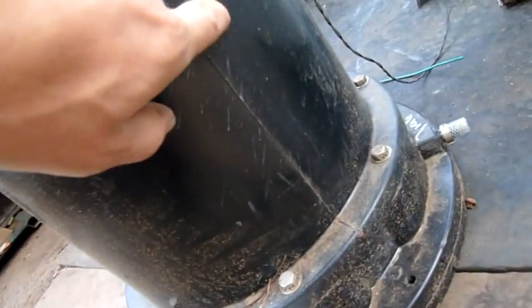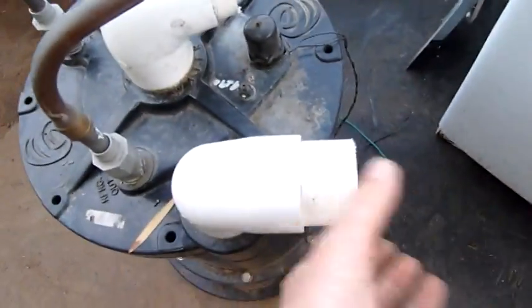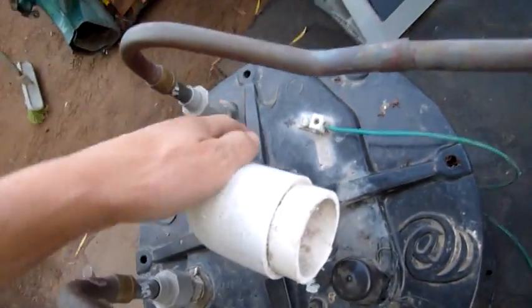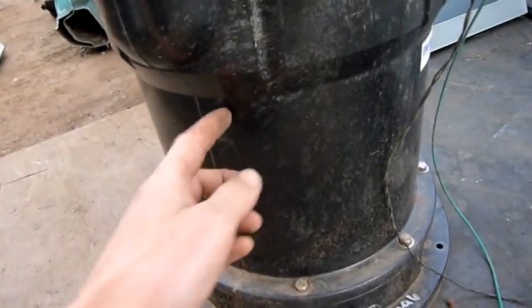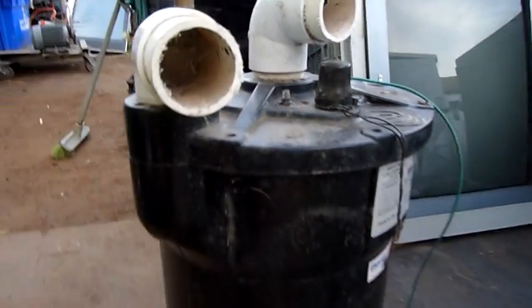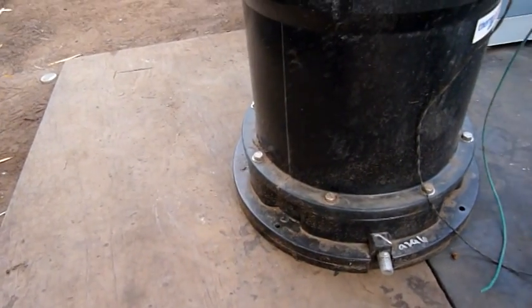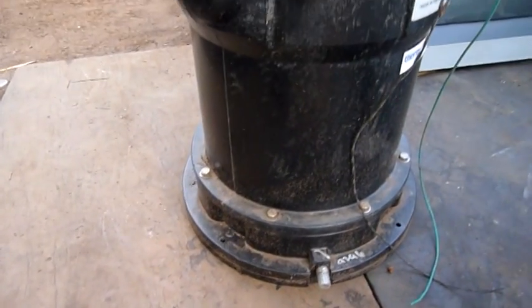It split down the side — there's a split through there. This outer shell, I think it's either PVC or polypropylene, I'm not too sure. There's a big crack right through there below where the outlet or inlet is. That's water out, and that's water in. So right near the outlet it has split. I'm thinking maybe it was clogged up with PVC residue from the extruder that it was servicing, but as you can see there's some black stuff stuck in there, and that's not algae — that's chemical residue from the water that gets discharged over the soft, flexible PVC extrusion to cool it down.